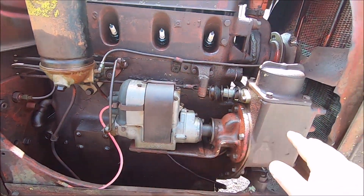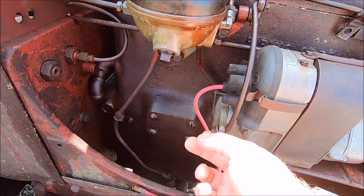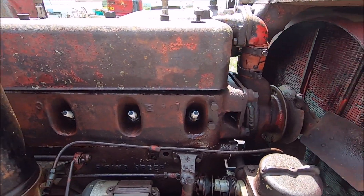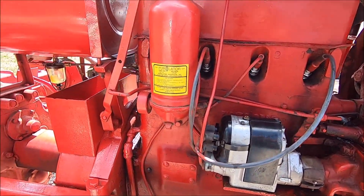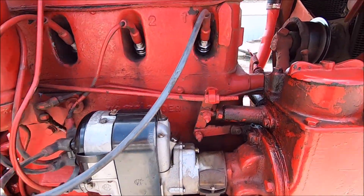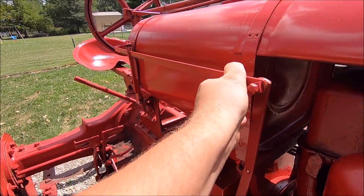It's the same magneto/governor setup. The throttle is different and so is how the magneto advances and retards, but it all works in the same style. Coming over to the F20 tractor, it's all fairly much the same — same governor housing, same magneto. This is where it's different right here — this little deal goes to the F20's throttle.